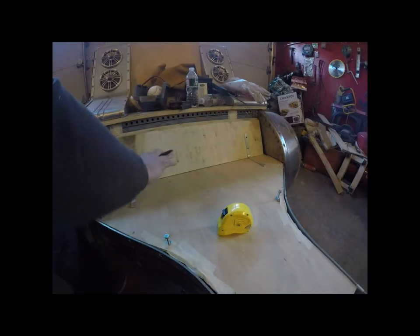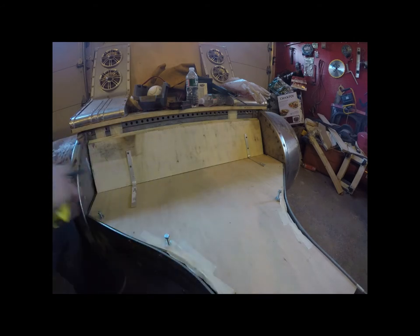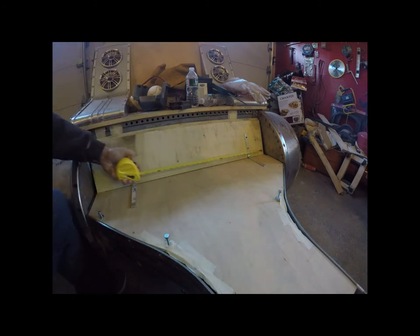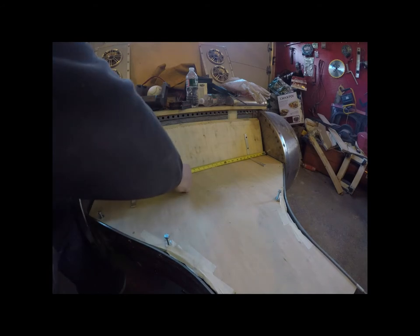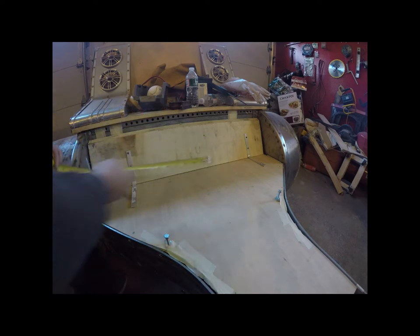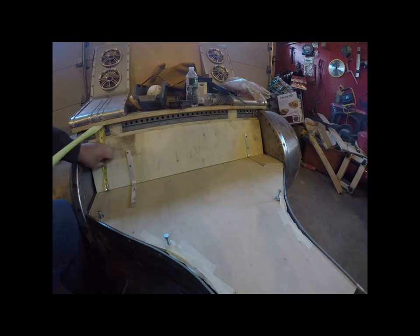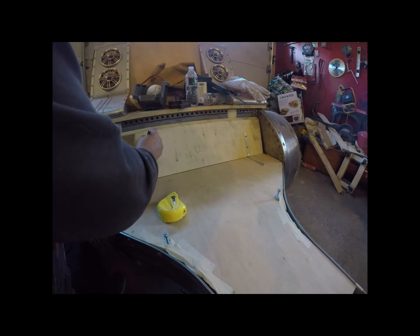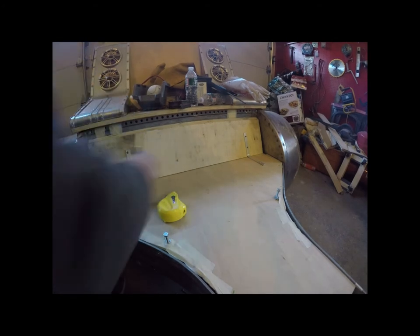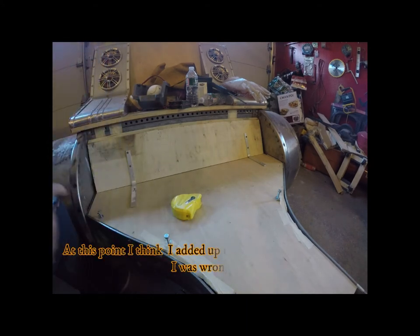I have the back piece in. We know the cut needs to be a little wider on the bottom compared to the top. What I did was measure from the inside of the metal strip that the sheet metal will tack to, then marked it out two feet. It's easier to get a measurement like that instead of trying to bend the tape measure in for an accurate reading. Nine and a half on the up, and then the width — 36 and one eighth on the bottom. Let's measure this out and cut it.